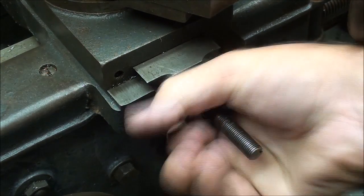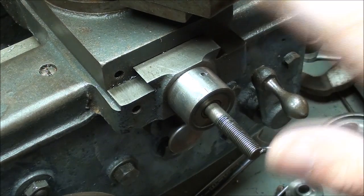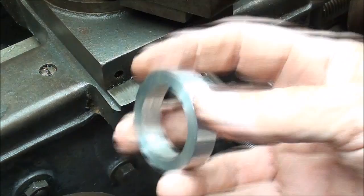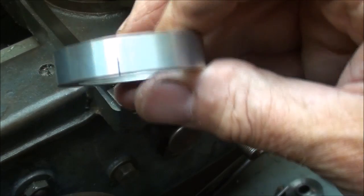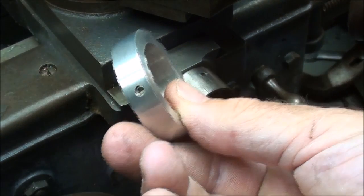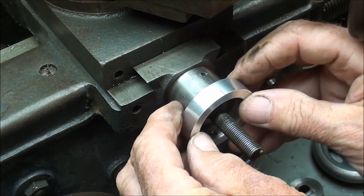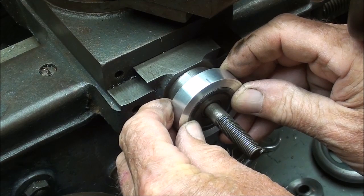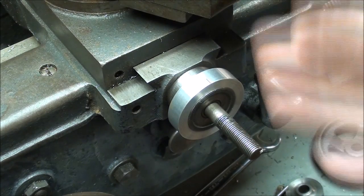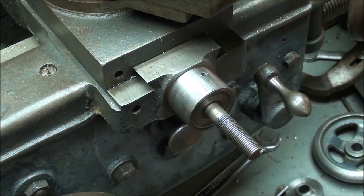When that tightens up, the zero mark should come to the top. The way I'm going to do that — there are two alternatives — I've already made one collar here in aluminum. Notice I've got a witness mark on there and a set screw on the bottom; it's an 8-32. That can simply be put on here, tightened down, and that can be as far as you go. But I prefer the next method — that's simple enough to make.